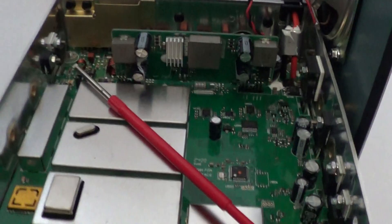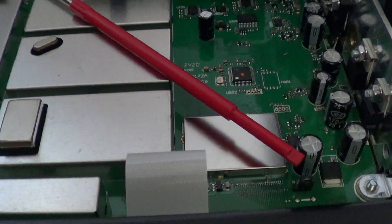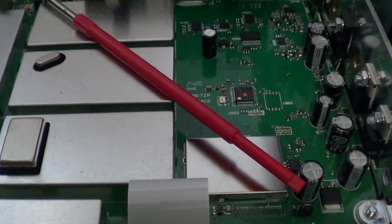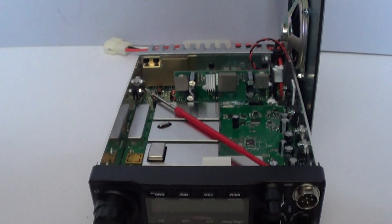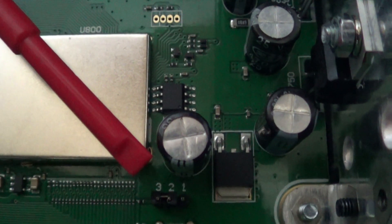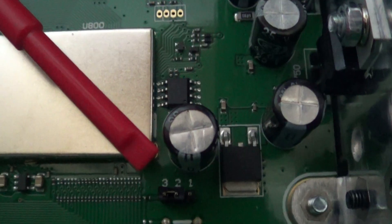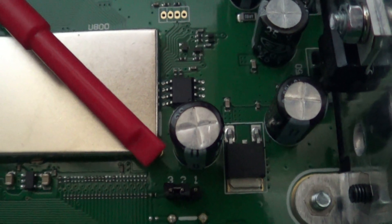When I did have a look around the circuit board I did miss it — I actually saw it and wondered what it was but it didn't really click. Anyway, we found it in the end. So that's your jumper — just move it across. There is also software which you can program the various frequencies in, and plug it into the back panel. The modification is basically: move the jumper. It's set on pins one and two from the factory, and you have to lift the little jumper off and move it from two to three. It's straightforward enough but it's so minute it's a bit of a struggle — you definitely need a pair of tweezers, you'll never do it without.